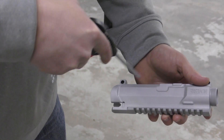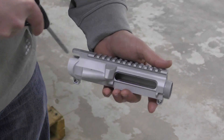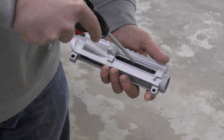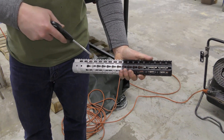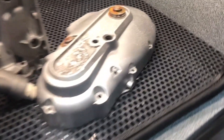But if you dry the parts completely, that's how you eliminate this from happening. Sometimes people think you can vapor hone a part, rinse it off, blow dry it a little bit, set it on the shelf — no. What happens is it's gonna start developing that white powder, or it's gonna spot. You're gonna have dark spots, light spots — it's gonna be a problem.